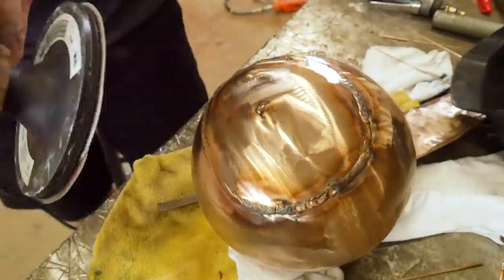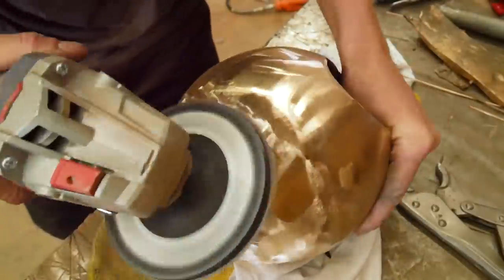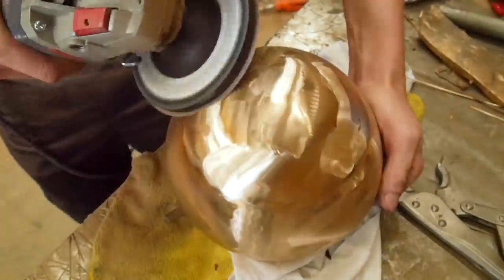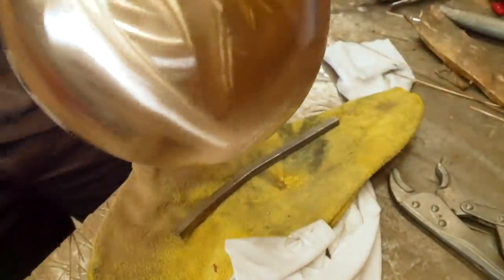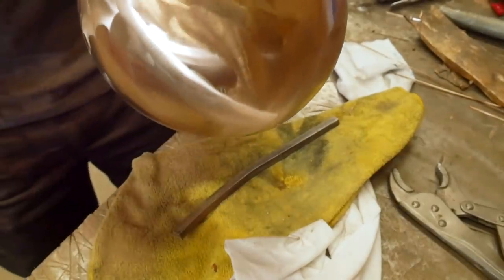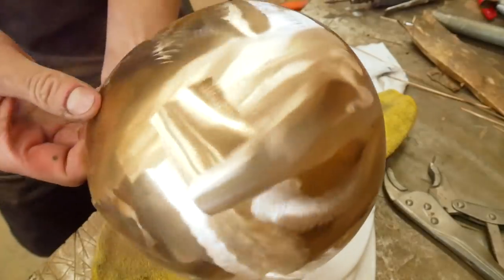Now to immediately remove the welds. They get a rough sanding and blending with about an 80 grit to remove the seam line. That's one window down and it's starting to look more like a balloon. After this, we'll do the same process with the isolated balloon knot. Here's a view of the roughed out main balloon section.